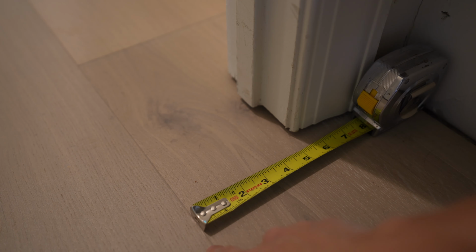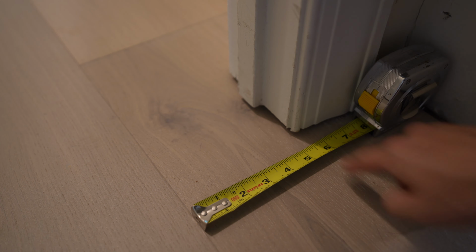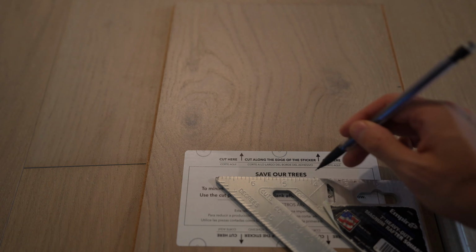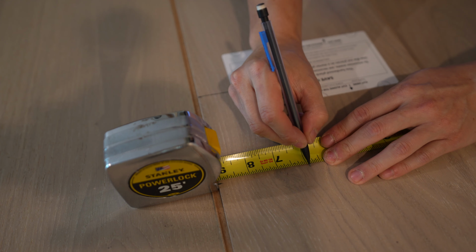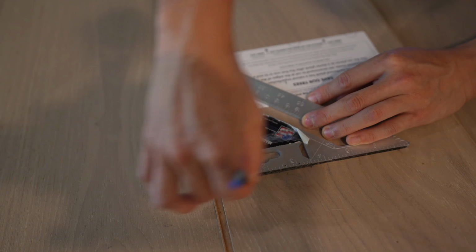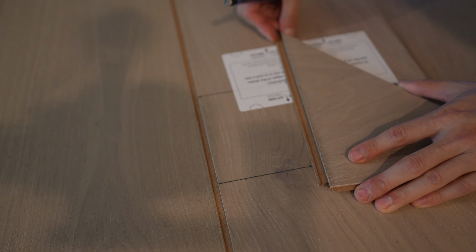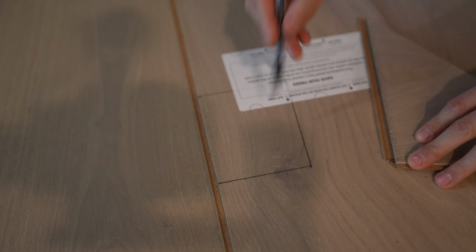After that, you'll be using a tape measure starting from the previous plank to where the end of the notch needs to be, like this, giving you the width of the measurement. Now you'll transfer that measurement onto your plank while lined up on the previous mark. Use a speed square or other straight object to line up and mark the area that you need to cut. Typically, with cuts like these, you'll need to use any combination of tools like a drill with a drill bit, jigsaw, and a saw.